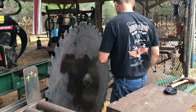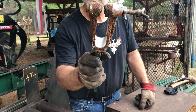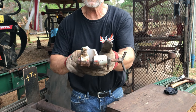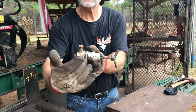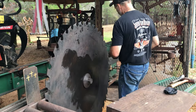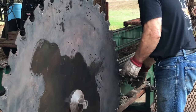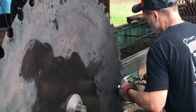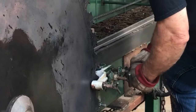There, and I'm gonna put the blade guide on if I can find it. Here it is. So the blade guide is two dowel rods. Screw it in here. This one right here is adjusted by this motion here, this adjustment. So I get just a hair of light on this side over here. And then I run this end, so I just have just a hair of light on that side. So that's with the blade idle. Once you start running a log through there, it'll bow up and change on you. Okay, just a little bit of daylight there on that one. Lock these down.